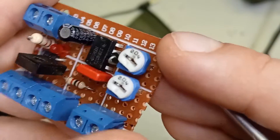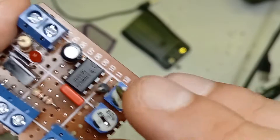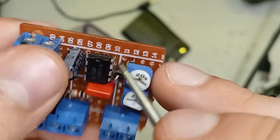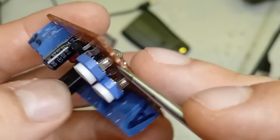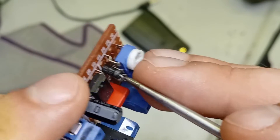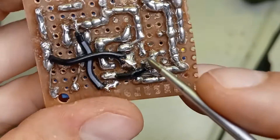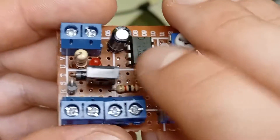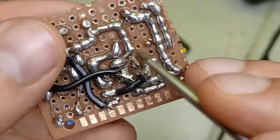Then we want to connect the potentiometer between pin 8 and pin 7. The reason we're going to pin 8 is because that's connected to positive voltage and it's right next to pin 7 so it just makes things easier. With the potentiometer you have three pins — two pins down one end and the wiper pin. You'll need one of these pins and the wiper pin. So this is pin 8 — we've connected that straight over to one side of the dwell time potentiometer, and then we take the wiper pin and run a trace of solder down to pin 7. Then take your remaining 1N4001 diode, put the anode to pin 7, and connect the cathode — the banded end — to pin 6. It's been soldered directly alongside the chip. Next take the 10 nanofarad polyester capacitor — this is non-polarised — and connect it to pin 5, then connect the other side to our common ground.